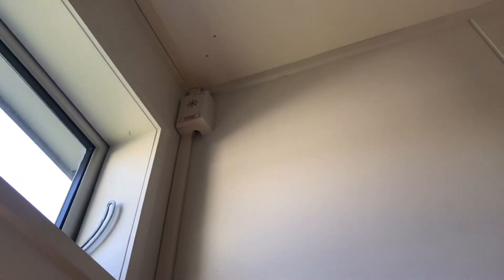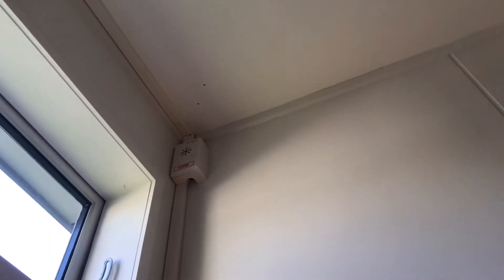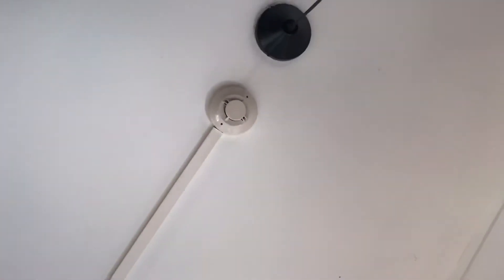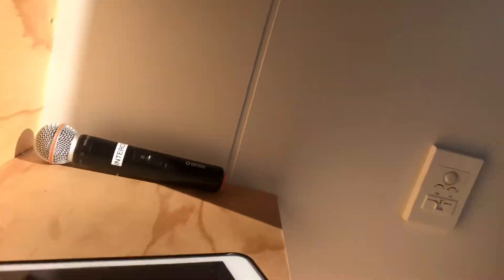I got it into the pin at the same time as holding the camera — tricky. Okay, close the door so it's a bit easier to hear it. This is another one of the quiet ones — it's a PSS-1, that's the model number, and they're quite quiet. This is a test of the voice evacuation system. This is a functional test for system operation, loudspeaker coverage, signal level and speech intelligibility. Okay, you can at least hear it. I think that one's at its loudest setting.